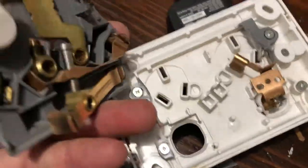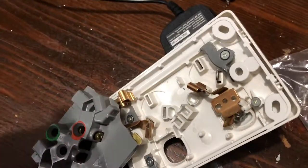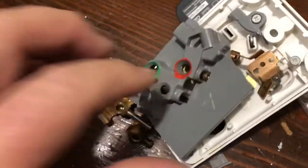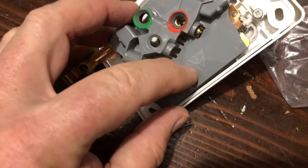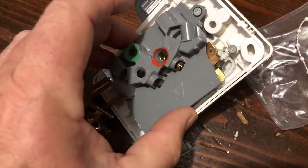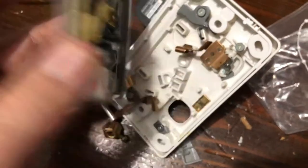So that is very dangerous. That's a very dangerous situation, because you've got power trying to get through, so it sparks and jumps. It's bad for your appliances — it'll blow them up, particularly electronics — and it's obviously bad from a fire point of view. That's what's inside a power point, and that's what's inside a broken one. You can see it's got an Australian-made symbol on it — it's actually a decent quality power point. But once they break, you do have to replace them, because they become dangerous. There's nothing holding this in place from behind, so it was free to flop out and have that bad connection.